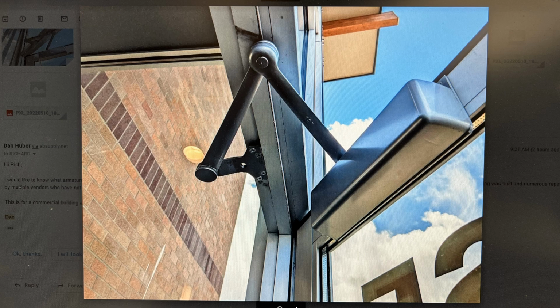And then one other question. I noticed there's like a chain or something that some people have added on some doors. Is that something? You can add a crash chain, but if you're breaking floor stops, you're going to break a crash chain. That's what I was wondering. Okay. Yeah, I mean, put it on, but it is not the right hardware for this.